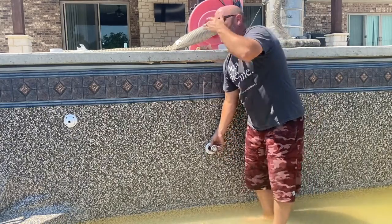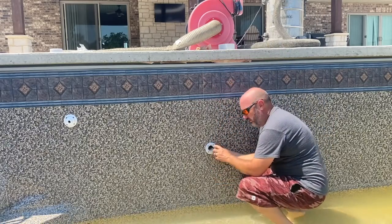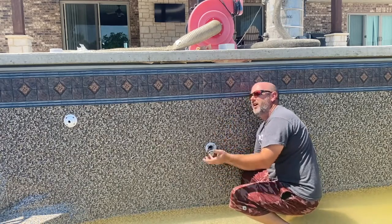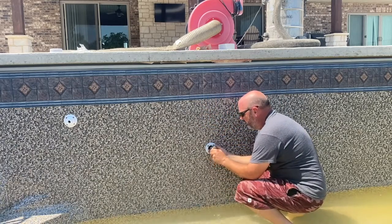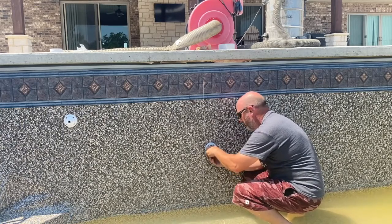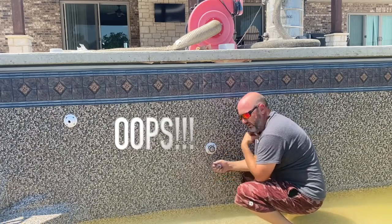Hey, can you bring me the wrench, Petey? I forgot it. Okay, now this is one that they won't, it's in the directions, but because of the threads, if I start spinning this, I'm going to twist the wire up till it's balled up. So you don't want to do that. What it tells you to do is counter rotate that wire 4 or 5 times, so you can actually feel that wire starting to ball up the wrong way. And we're going to put it in here. Okay. Hey Pete, I forgot the Teflon tape.